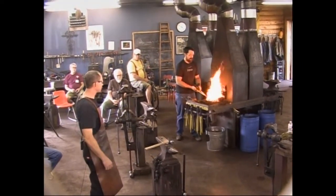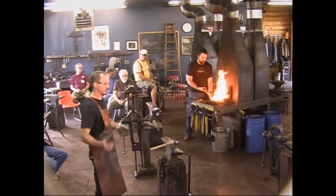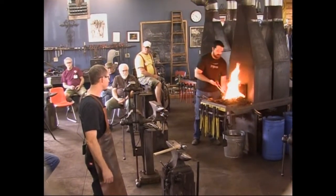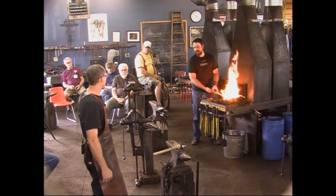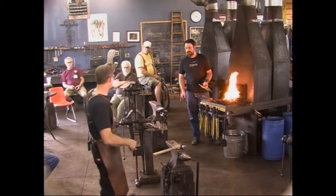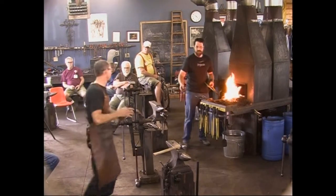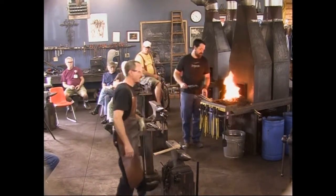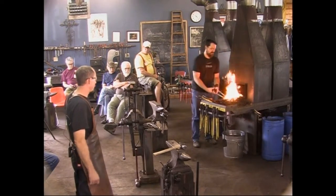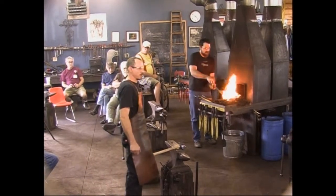So like I was saying, I don't know what steel this is. I've made my best guess. I know it's around something similar to 1080. Like I said, I'm going to treat it like it's a very fine tool steel, preheating it. I'm going to use the old cliche method of checking it with a magnet to see when it's non-magnetic in terms of hardening it. We'll talk about that some more later, but that's what I have to do right now to make my best guess.